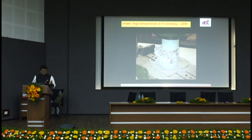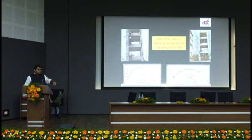When you do any research, economics is back to back. When I retrofitted this structure, government officers and almost 300 consultants asked me about the cost. There is a guideline: if your cost is more than 30% of new construction, demolish the structure. We were at 19 to 20% of the original construction cost, and the time duration to restore the structure was 11 days.